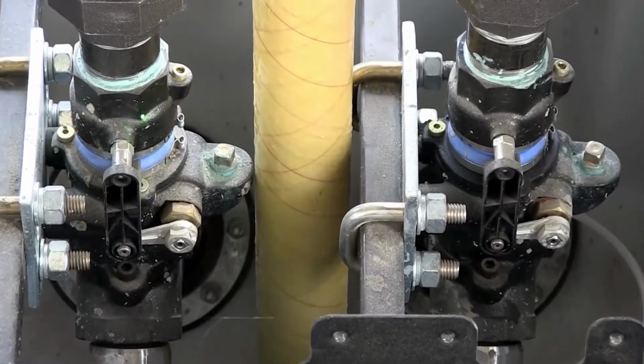Specifically, when you're inside of a containment sump, you're also going to look for, this is called a shear valve. What this is for is that if the dispenser gets hit, it'll shut off a valve to prevent fuel flow from happening in a fire. Also, if there's a fire, there's a piece that'll melt. So you want all this to be in good condition as far as the manufacturer specifies. You also want it to be mounted securely. So you're going to look for all mounting hardware to be secure, everything to be attached, and no leaks happening.